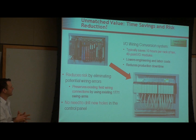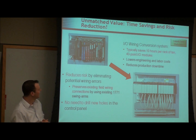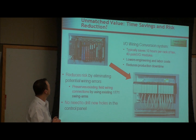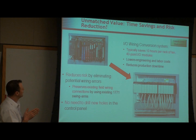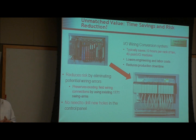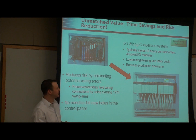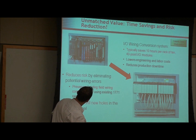There are a couple different options with the PLC5 system you currently have running. You can leave it there, keep your fingers crossed, and buy that expensive processor when you need it. You can do a rip and replace, as Matt talked about earlier — there's obviously some significant risk involved in that. You can do a stepped migration where you pull out one of the PLC5 racks and put in a new ControlLogix rack. We also have a wiring migration system that's going to save you some headache — you actually don't have to rewire any wires except for maybe the power. Saves you tons of time.